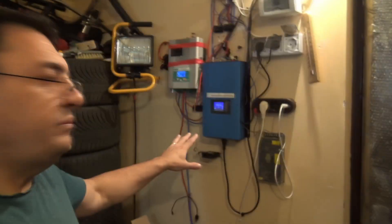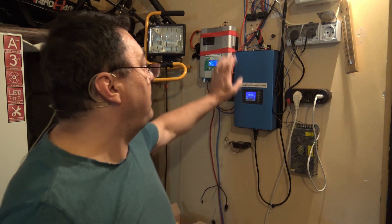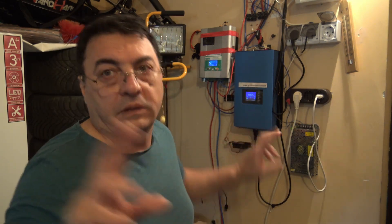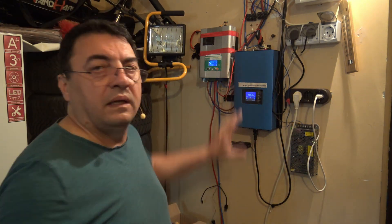Hello again, Sunday at noon. You remember I had those lithium-ion batteries down here — they are gone. Why? Because it proves that my install is too small. It's not enough power from the solar panels to feed, at the same time, the on-grid inverter and charge the batteries. I only have around 1,500 watt-hours of panels, and that's not enough to feed 7 kilowatt-hour batteries. I had to give up because I can't fit more panels anyway, and for now I'm okay with this install — that's a really nice surprise.